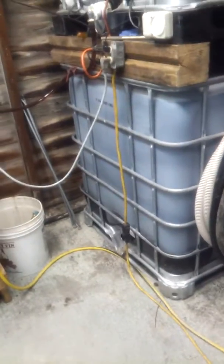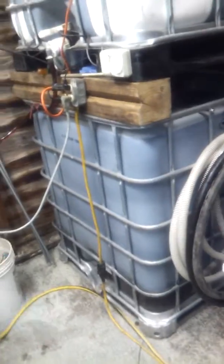That will be all the oil from — as they say — the top 200 gallons of each tote will be pulled off and put in there, since these have been sitting for about two months after processing. You can see there's a little creamy layer at the bottom. I'll pull off the top two thirds of each tote that's been sitting, giving them a chance to let the heavier centrifuged stuff settle. That way I'll have the thinnest oil in the 330's for winter use — it'll require less work and it'll be easier to heat up.